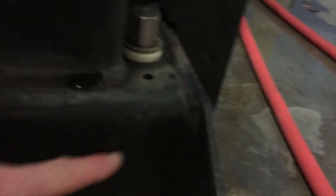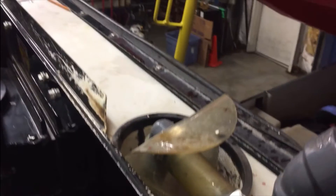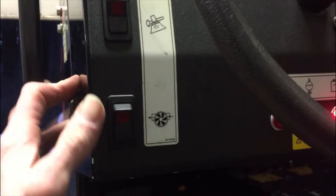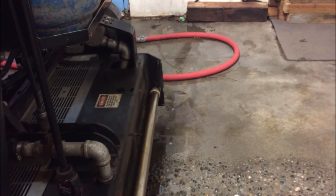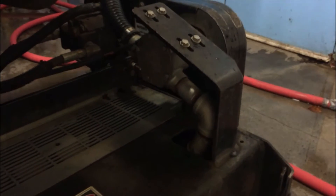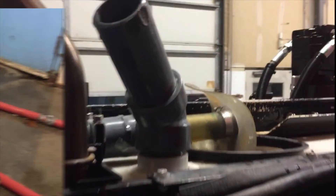There's a little intake hose right underneath there, it comes up here, then there's a 45-degree elbow, then it comes over into the wash water pump, which pumps it all the way back and up the side. It comes out right here, loops down into the basket, gets cleaned and recycled. Over here we have the wash water pump — about 20 seconds after we turn the water on, the pump clicks on. It's an electromagnetic pump; the auger chain is always spinning but it doesn't engage until we hit the switch, then it engages the electromagnetic clutch.